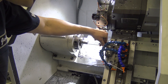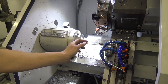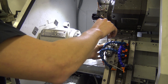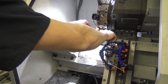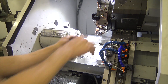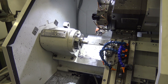There's no real clocking of it as far as I can tell. They did have a flat when it came from Shars, but that flat is now gone because I turned it down. I was testing the tolerance as I turned it — if I'd had any trouble I was going to turn it slightly over and go to the surface grinder and use one of those whirly jigs. Tom Lipton just did an awesome video on making a homemade edge finder, but we didn't even need to.